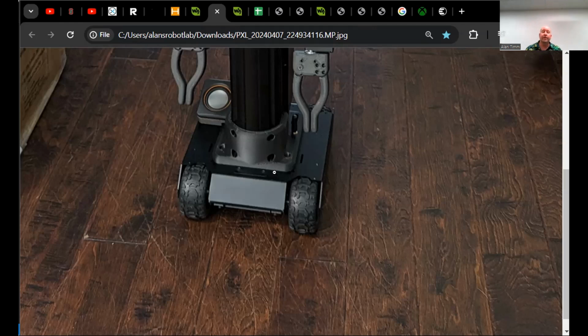We're going to use ROS to facilitate the communication between the main computer and the ESP32 microcontrollers. So we're coming up with messages that look similar to this. For the movement, tell me where you want me to go, how fast, and what the acceleration is. There's a similar set of messages for the wheels and for the lights in the head. And after that, what I'm calling brainstem code is all boilerplate. Then we can start writing some programs that make the robot come to life.